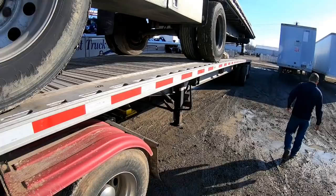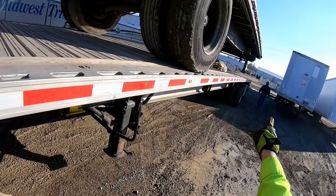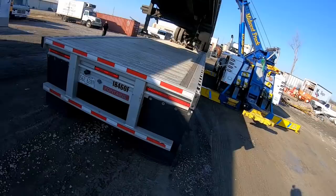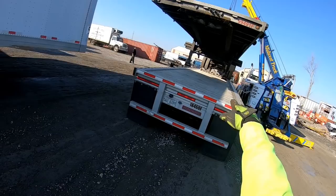Okay. What? Okay. All right. Now, hold on. You know why? Because you're fronting your trailer a little bit. Probably. Let's look and verify. All right. Now, what's happening is you've got the teeter effect going on. Yeah. Okay. Let your blue down, and it should bring the rear axle up a little bit.